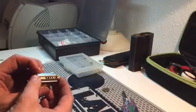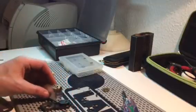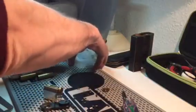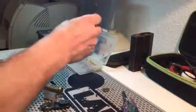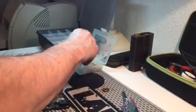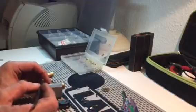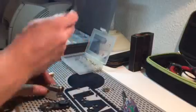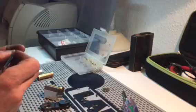So now let's look inside, and we can see we need some different drivers to make a balanced pin stack, as we do with the Rukos. So the first one, we'll take the S4, give it a try, and see if we get above the shear line. Looks fine. The next one was a 7, so we'll take a number S6 standard driver.